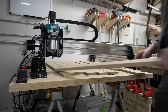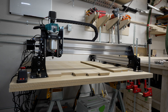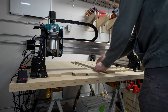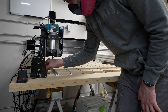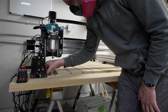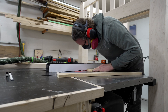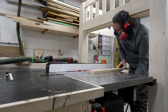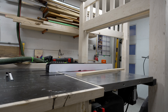Then it was time to lay them out and put the T-track in. I measured the overall width — I knew there would be a little bit on each side and wasn't quite sure how to deal with that. I put the T-track in between each piece, held it together, and measured the total distance to the side. It worked out to about 13/16ths for each side. I then used a normal ripping blade on my table saw — which I guess answers the question of whether the dado is necessary. It is not.